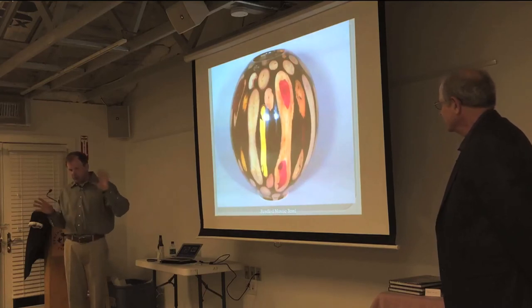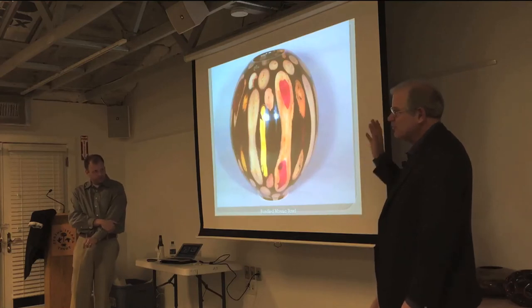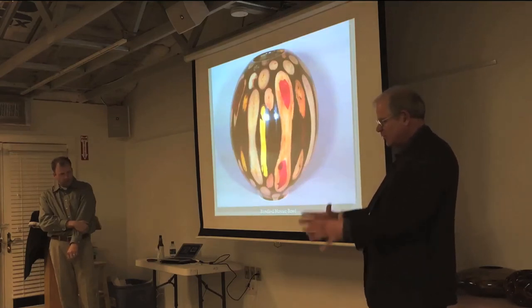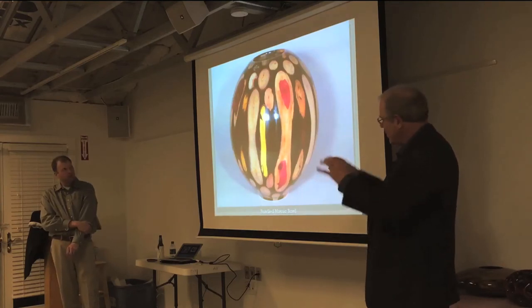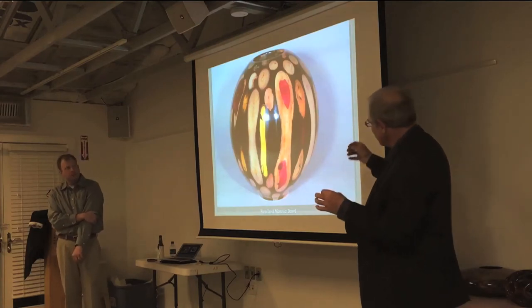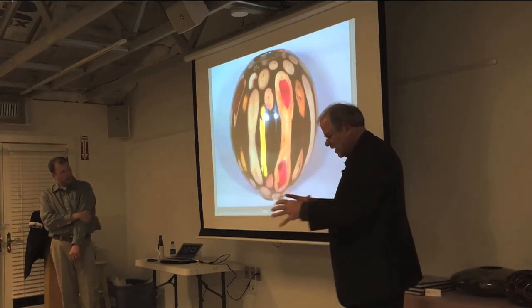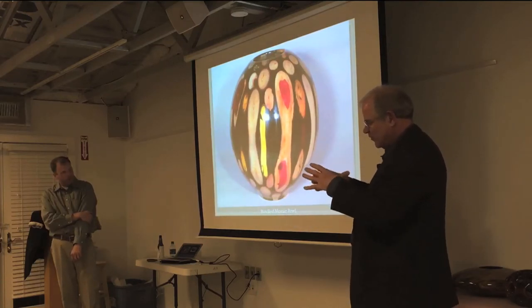This is a mosaic series. My father created that, which was wholly unique to his direction of work. Obviously you can tell this is made up of multiple pieces of different types of trees. What I've actually done here is take a round, cylinder-shaped form, for one this size like a five-gallon pail, because it's fairly uniform. I cut all these sections the height of the pail, and I put them in the pail in the order that I want them to appear on the outside of this bowl. Like the red cedar here, I have probably five pieces going around the side, spaced out, and then the yellow mahonia is spaced around in different places, but I keep putting these pieces into the pail.